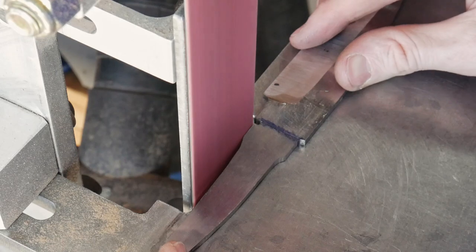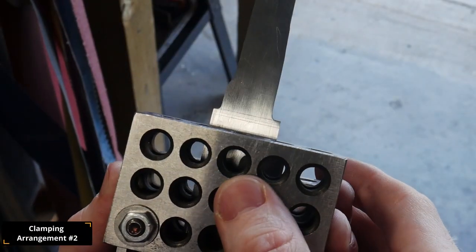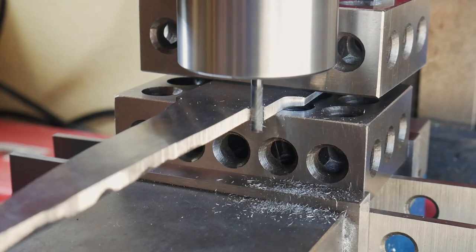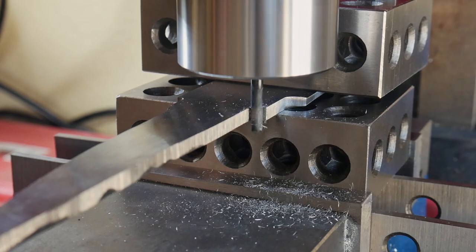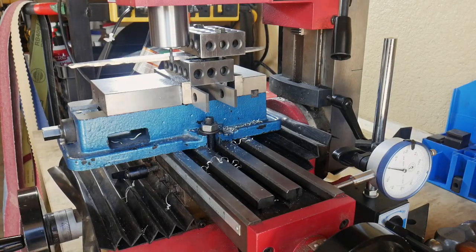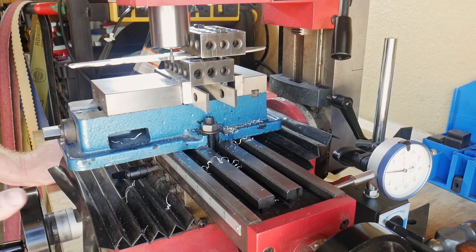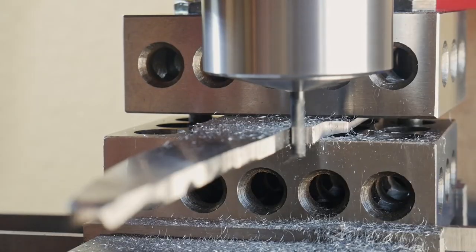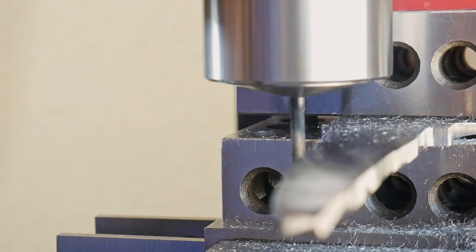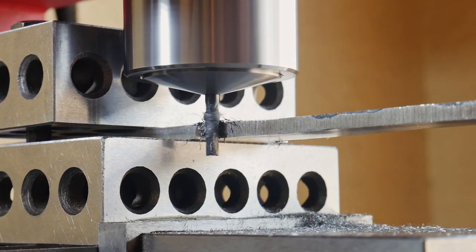I took off the bulk of the material with the grinder and my first clamping arrangement, then lined everything back up, clamped it between two 1-2-3 blocks, and put it back in my mill to clean up all the shoulders and flats. We're getting the shoulders square to the knife and in line with each other, and also milling the flats toward the tip of the tang where my guard and spacer will sit. All in all the milling process was not too bad, and I think I will continue to use this method for making my shoulders nice and square on hidden tang knives in the future.